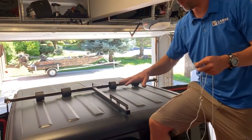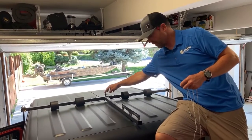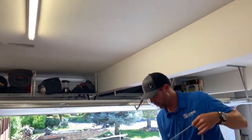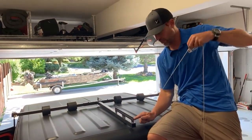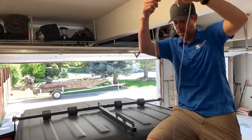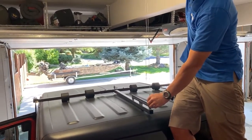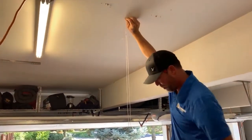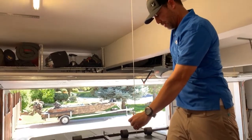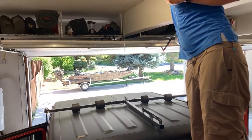I've put the lifting frame on so it gives us a good reference of our lifting points. It's 32 inches from this hole to this hole — this is the front lifting point and this is the rear lifting point. The wire cables will go straight up from these two points. I don't have a fancy plumb bob, so I'm using a small tool tied on a string. I'll hang this to the ceiling and when it hangs straight, I'll mark with my pencil — that's my lifting spot for the back, and I'll do the same for the front.